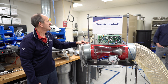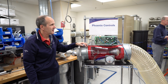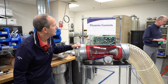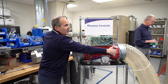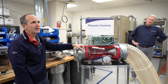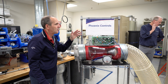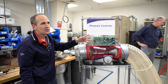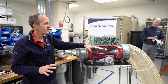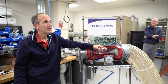The other thing we like to demonstrate is what goes on with the kim wipes, to show you what happens if these clog. We'll give it a second before putting anything in because the air station is going down. It adapts to any interference, similar to what I just did with the damper — it doesn't matter if it's a kim wipe or a damper. It may make a rattling noise in there for researchers for a short time if you drop something in. Obviously if you block the whole thing entirely it would be a problem, but under most circumstances — dust, dander, bedding, lint — they won't impact performance at all, even after years and years. The velocity of air through that venturi is very fast, so things don't stick to it.